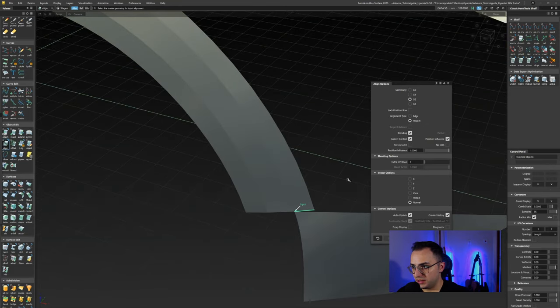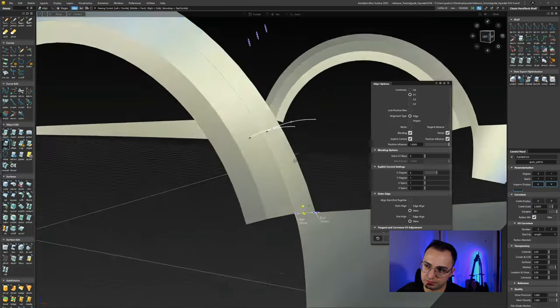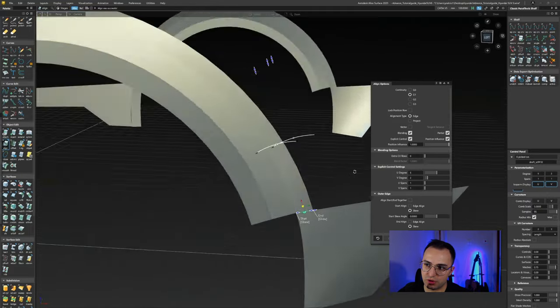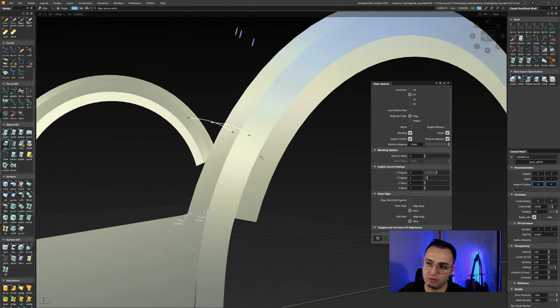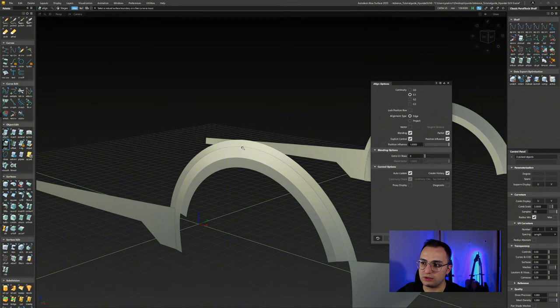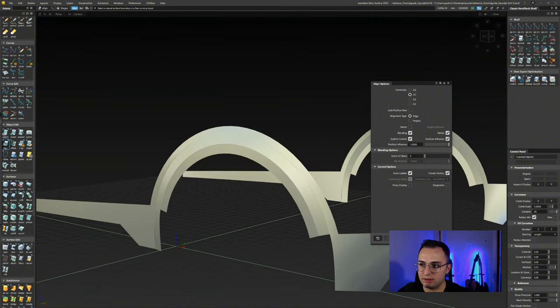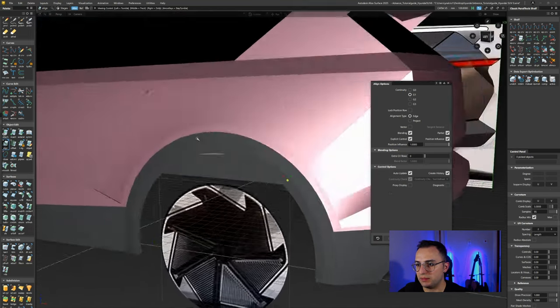Yeah, I will be G1 aligning that surface so that, transitionally, that curve over there, the intersection of the chamfer, will wash out through the rear panel and the rear surface over there. It'll be tangent, so it's kind of washing out. Yeah, not that bad.